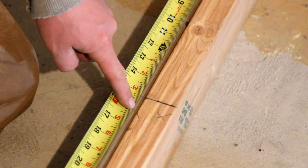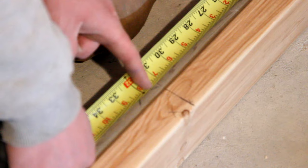Now we're going to keep our tape on that end for accuracy, so every stud is just 16 center minus three-quarter, lined with an X. So this one here is 47 and a quarter — mark here.